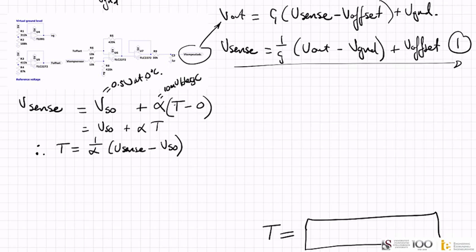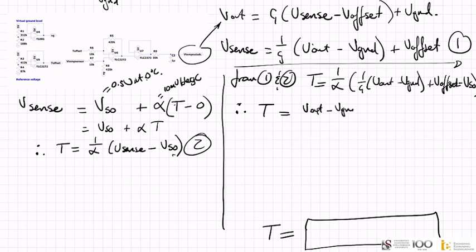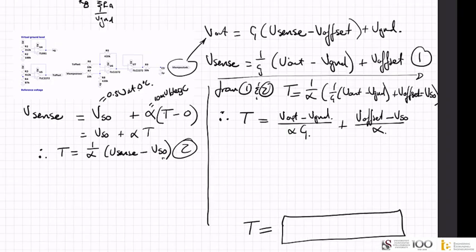What I'm doing is an analytical solution to my circuit. I'll mark this as equation 2, and combining equations 1 and 2, hopefully the penny drops about why I chose this configuration. I chose the offset here to cancel the sensor offset. The V_offset should cancel the sensor offset, which is why I chose V_offset to be very close to my sensor offset at 38 degrees — because we wanted the whole thing to hinge around 38 degrees.